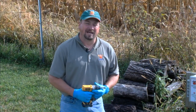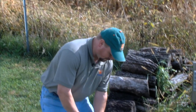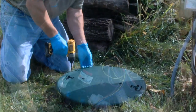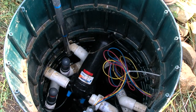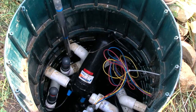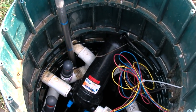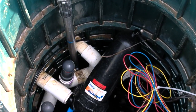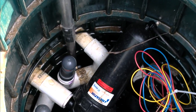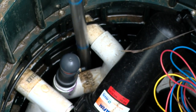To gain access to the pump tank, we're going to remove the lid on the system. We're also going to sample the pump tank to make sure we don't have any excessive solids carry-over. If we have a lot of solids showing up in the pump tank, we may have surge events that carry over solids, which can clog the drip filter and the intake of the pump.